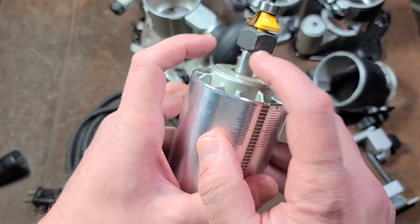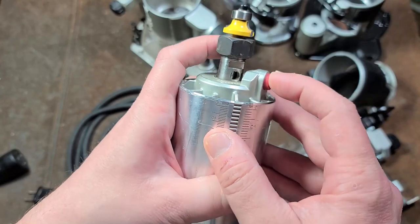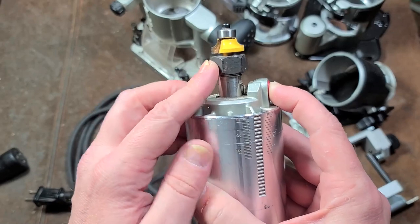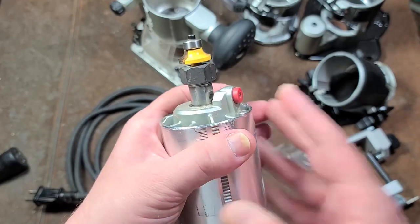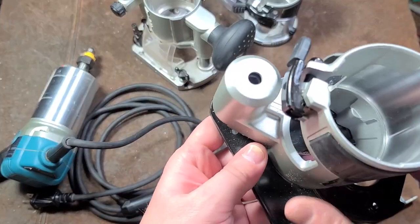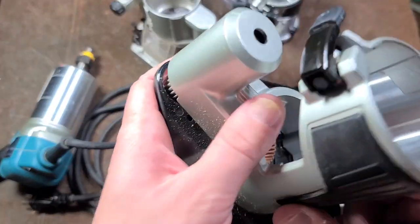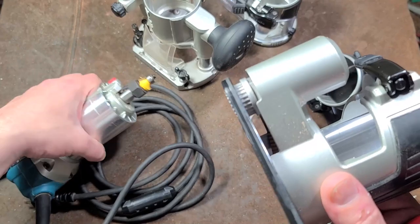I like the fact they have 14mm flats on the spindle. They also have a lock peg which is convenient. Interestingly, the collet nut sizing is 22mm — or actually seven-eighths inch — which is fractional. We know that partly because of the accessories: there's an offset base which lets you get closer into corners and tight access places, and it has a gear that threads onto the spindle.